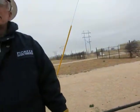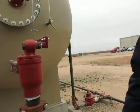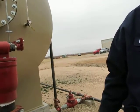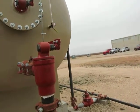Mr. Blood, one question. Yeah. So we send the oil to the heater treater. Right. Okay, so do we have some oil in our water also that is available to separate, or do we just dump them? If it separates out of here, we usually dump it. We don't generally find enough oil to carry over in water. Not usually, but you can.